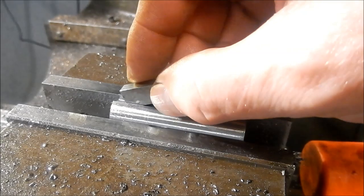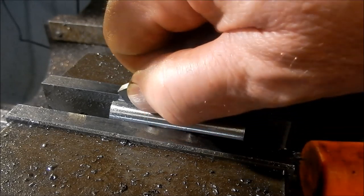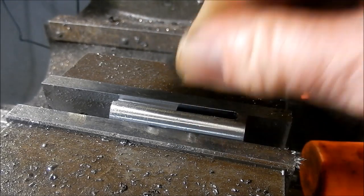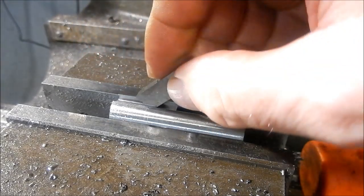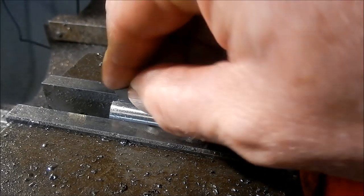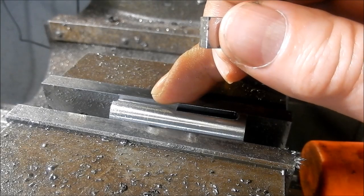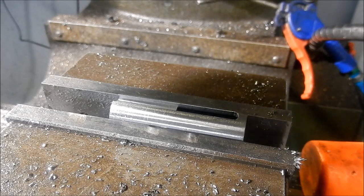Alright, just before we do take it out, that's a 5 mm slip gauge, and that is a nice firm fit in there, and I'm happy with that. So that key is just very, very slightly oversized by about 0.02 of a mil. Obviously this is bang on size, so yep, very happy with that. All right, we'll deburr that, and this part's finished, and we'll just wait for the pulley to arrive in the mail, and we can bore and rekey that one. All right, guys, we'll see you soon.